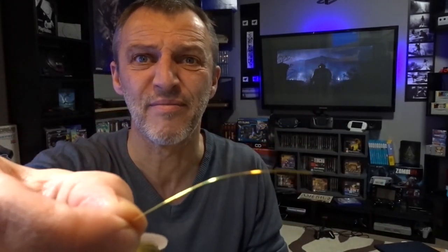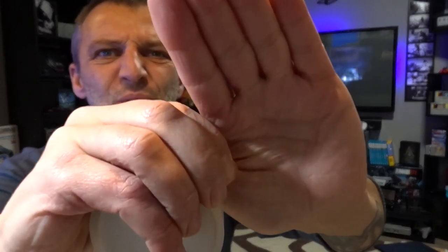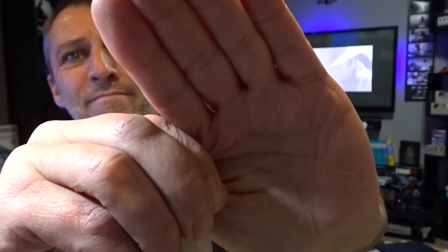But yeah, if you're not great at soldering, don't even attempt surface mounts. I mean, you've seen what I've just fiddled about with there. The wire I use here is 0.2 of a millimetre gauge. It's like hair. It looks really big there because the light's shining on it, but it's not. If I get rid of the light, you can hardly see it, if you can see it. That's how small it is. It looks massive in the scope camera. That's what it's called, so it scopes right in. So yeah, it does look big, but it's not.